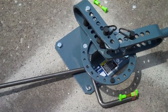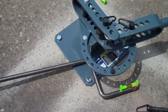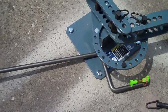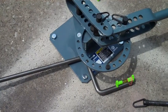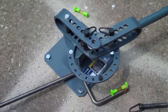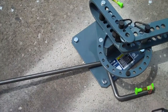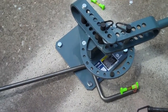To bend my half-inch rod, I came out and drilled some holes into my driveway since I don't have the base. If you have the base, you can bolt that to your garage floor permanently, or drill some deep holes and drop some pins in there — some half-inch screws. Grade 5 is best so they don't shear. I'm using my driveway because it's got a rougher surface than my garage and I can get some traction to get the bend. If you have a brand new driveway and you're married, I don't suggest you do that, otherwise you might be sleeping in the garage.